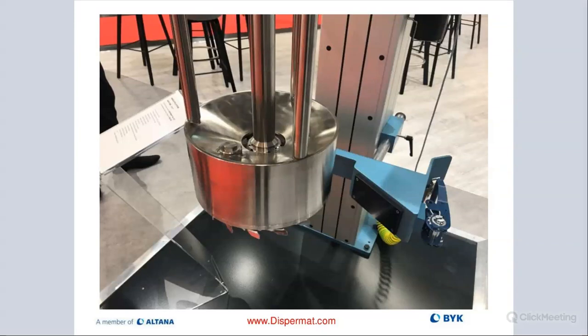That's the area where you have most of your energy or heat buildup. So this is where we are cooling the mill base, right behind these walls. If we have a screen right there, we can't do a proper job cooling. But most importantly, the beads are going to impact that particular area all the time, and by having a screen right there, we're going to see heavy wear on our screen. That means a lot of screen replacements. By having that closed up, we're not going to wear down our screen, and we're going to have improved cooling. That's why in our design all that is closed up, to give you optimum cooling performance and minimum wear on the screen.